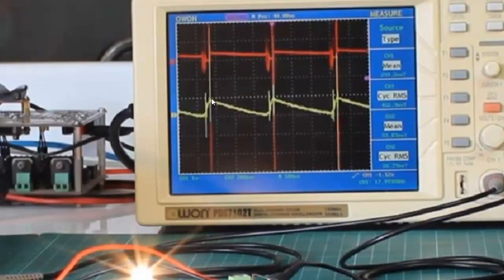Input coil on in this small rectangle here. That's where the input coil's on. You can see it here as well. Input coil is on in here. All this time over here is input coil off and partnered output coils doing all that work. Get your amplitude up, and what will happen is you have more energy in the slope there. I'll show you what I mean.